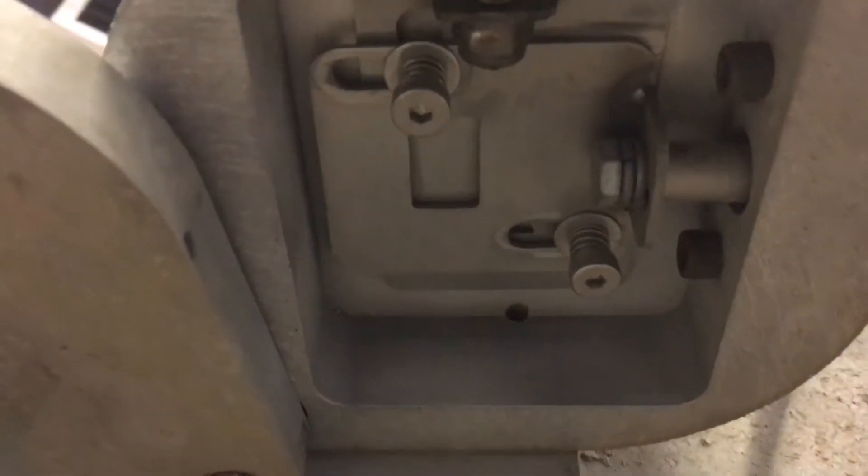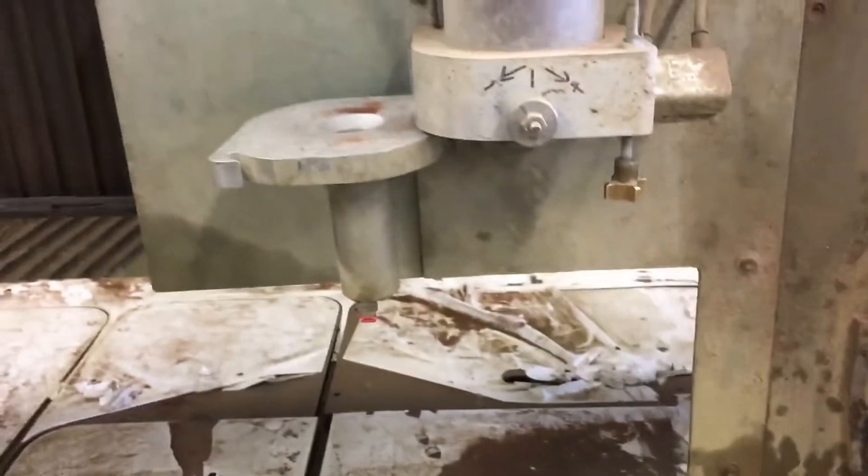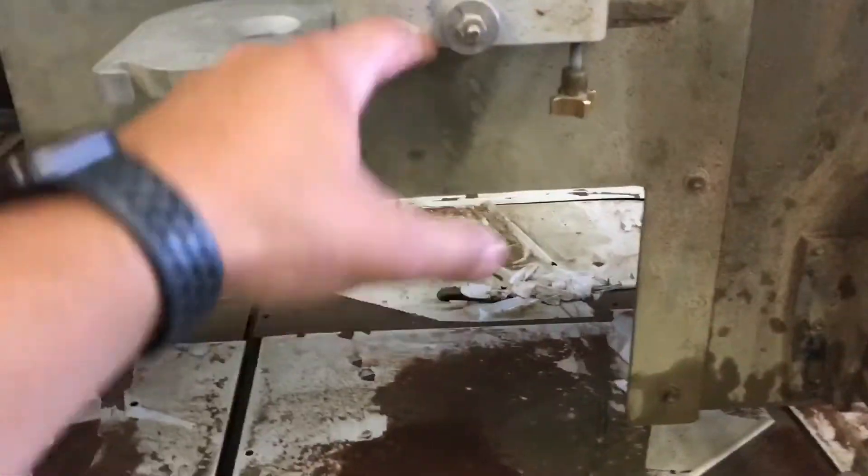The issue was, when you click water jet on, you can see right there the amount of sand that's flowing out. What happened was a little bit of gasket material or something — when someone poured the sand in the pressure pot over there, it wasn't completely clean and it got caught in that.